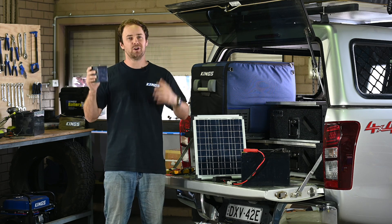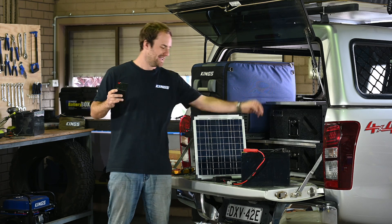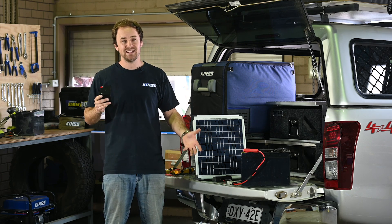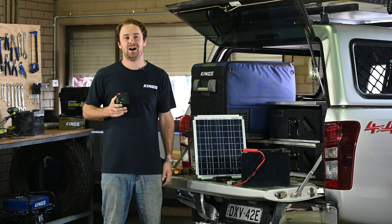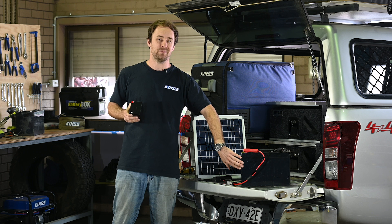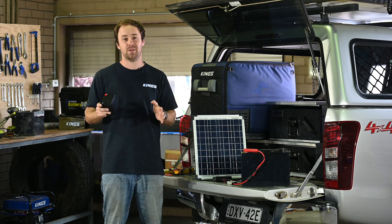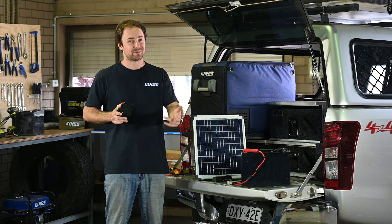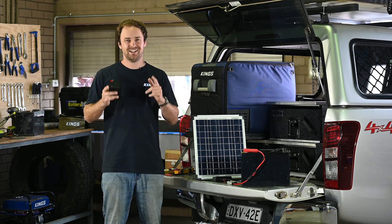So, a 4 amp hour 12 volt battery will easily run a 60 litre fridge freezer for a couple of hours — but whether you're using a small or big solar panel, it's not going to work for long. What you need is a battery with decent capacity and a decently big solar panel. In this case, bigger is better — get the biggest battery and solar panel you can afford for your setup. I've covered a lot of these concepts in more depth in my other 12 volt videos, particularly battery charging in relation to temperature and cycles, so I recommend checking those out. If you're into anything for driving or camping, check out the rest of the channel, hit like and subscribe, and drop comments below so I can answer questions or get ideas for future videos.